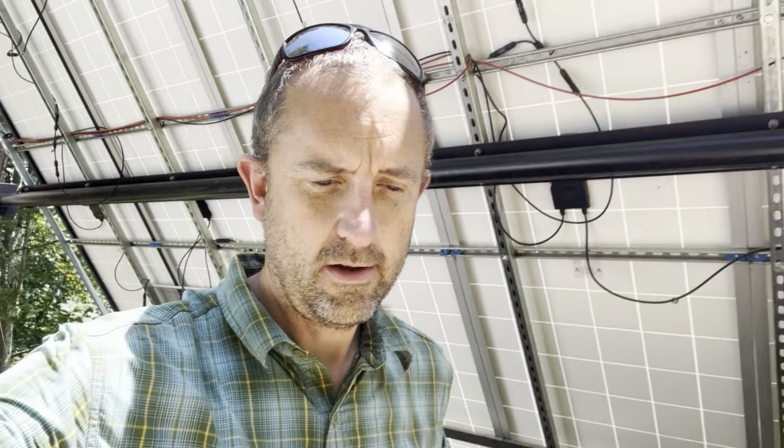But if it is sunny, you can make some pretty good power. That would be 2,500 watts every hour if it was actually producing 2,500. So think about how many hours of sunshine you have, and multiply that, and that's how much you'll get throughout the day. With another caveat: as the position of the sun changes, the power will obviously go up or down. Middle of the day, you get your highest output. Early and late, it starts waning off as the direction of the sun changes.